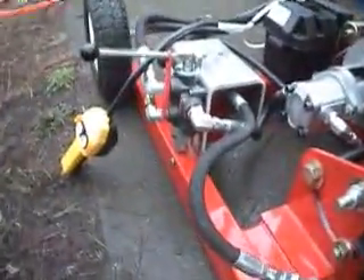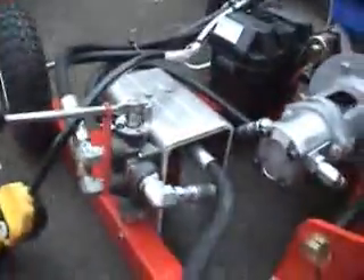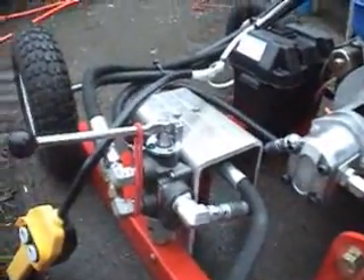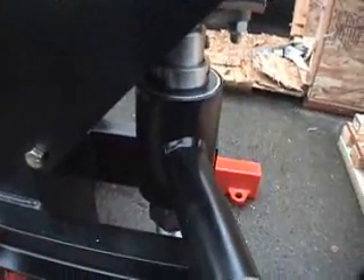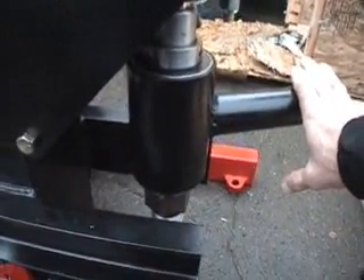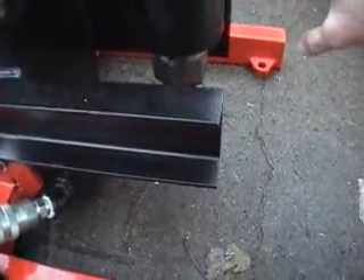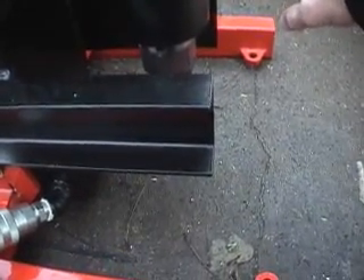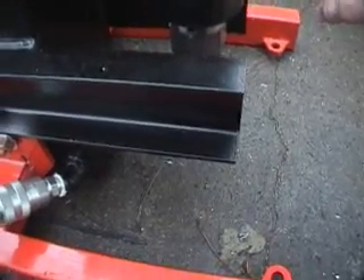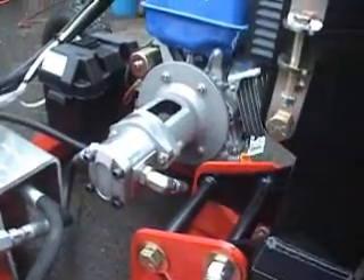The reversing control — not stock, didn't have anything on there. So we have forward and reverse. Otherwise, the way this thing was originally built, the pump powered the motor all the time and it continually ran. There was no way to stop the motor from turning. With the motor turning constantly, when the bit seizes in the ground, you're stuck because you can't run the motor since the bit won't turn, you can't pull the bit out because it's stuck in the mud, and you can't reverse it. You can't do anything — you end up totally screwed. So now that it has a neutral, forward, and reverse, it gives you latitude to continue to run the engine while you're extracting the bit.